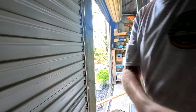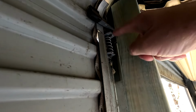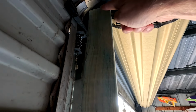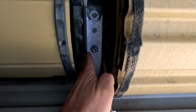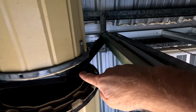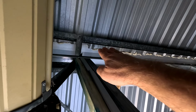And here on this side I had planned to use this wooden... See, that's what I meant here. Look at this wooden stud here. It fits perfectly in between this track. But up here is this whole mechanic where I can remove this track. And the door stoppers are here, and then the support starts for the actual roller doors. So I have to cut this out somehow so it fits into this shape here. Yeah, and then we will have plasterboard in between up to this metal support. A little bit of insulation in between. And then up here I have to cut the plasterboard on an angle to fit the support here for the roller doors. And the plasterboard will not stop where the top track is. It will go all the way up to the ceiling, to this metal there, where the spray foam is. All the way up. Anyway, you will see this later.